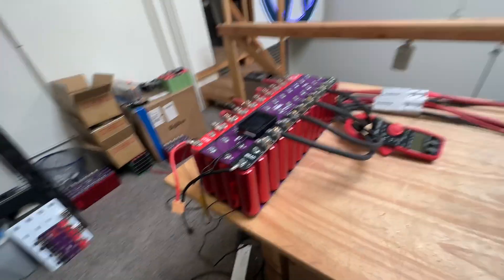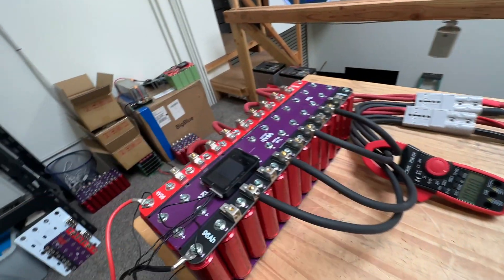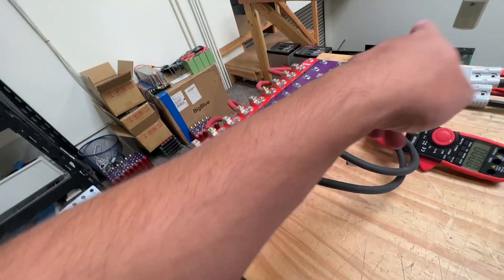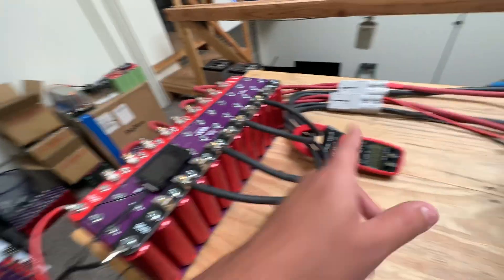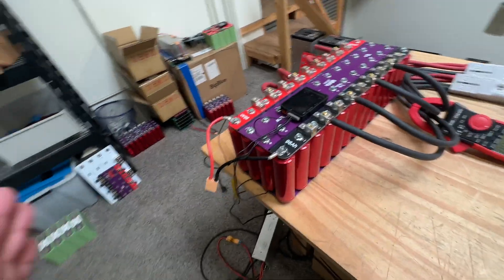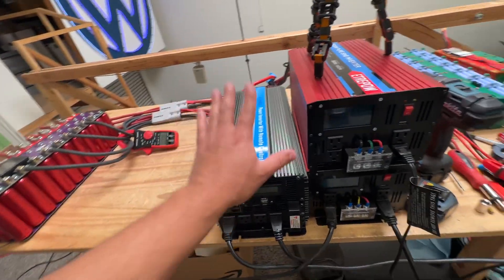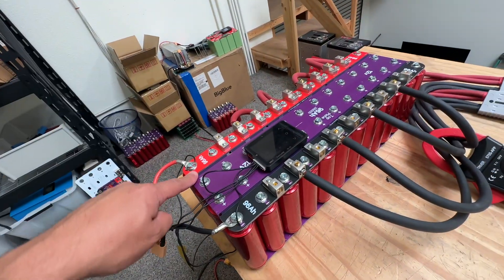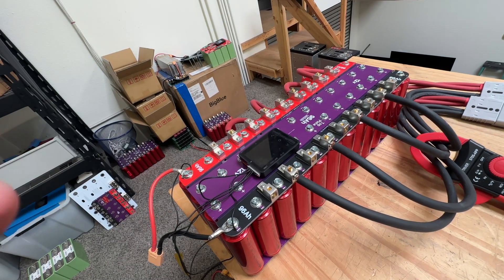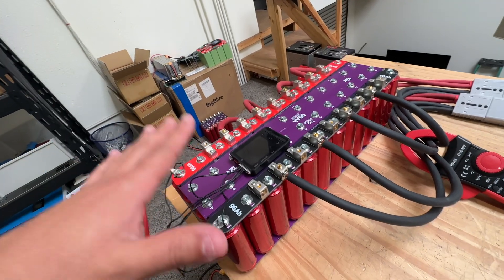So five hundred and it falls below twelve. Each row here can do about fifty amps staying above twelve volts. If you multiply that by all the cells across this pack, you get about six hundred amps — which is what we saw. After that it falls below twelve volts, which is not very usable for twelve-volt appliances or devices, whether in the audio world or for inverters.